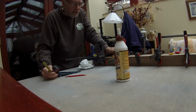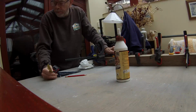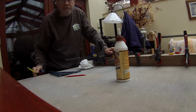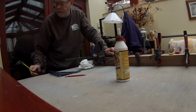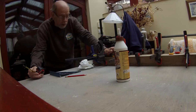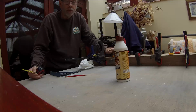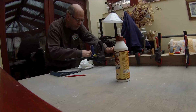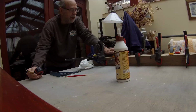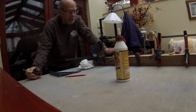I haven't really talked about materials much because I'm using what I've got rather than what would be ideal. Plywood is best. I've got a plywood top here that's about 11mm thick. I don't know quite why it's such an odd size, but 9mm is usually perfectly adequate for a top, or 12, but the mating faces where the boards join should probably really be 12, and I've only got 9mm, but we can live with that, I think, when we've got bracing in as well. The actual cross braces again can be even less than that. They can be down to 6mm.